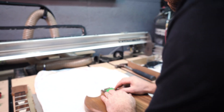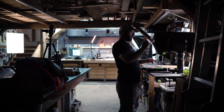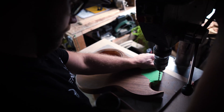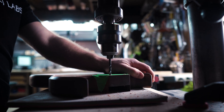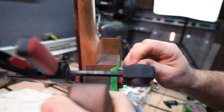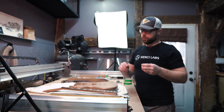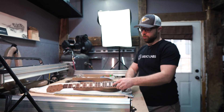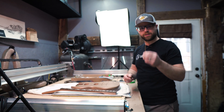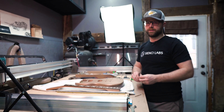Drill press time. It's important that the holes in the body for the neck allow the screws to pass through without threading in — you want the screw to thread into the neck itself. Otherwise, when the neck and the body are screwed together, it won't be as tight a fit as possible. Put the neck in place, use the body holes as a guide, and then mark on the backside of the neck with a screw, drill bit, or a punch. Measure your neck screws, pre-drill the holes in the body, then pre-drill the holes in the neck using a bit that is a little bit smaller, because you want these screws to bite into the neck, not the body.